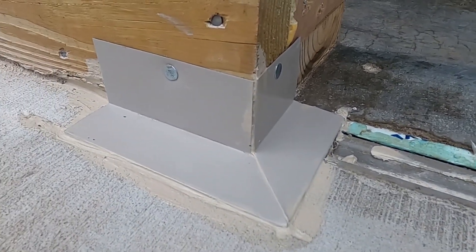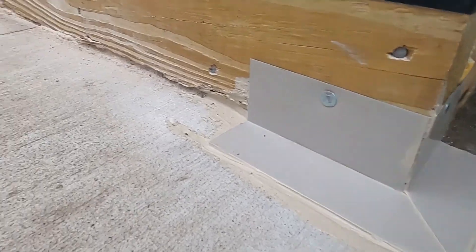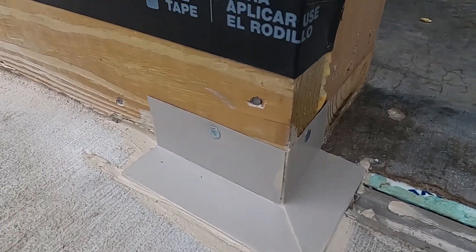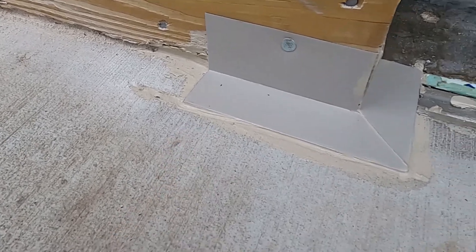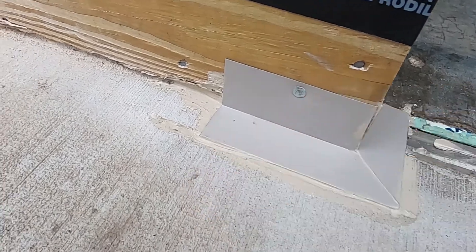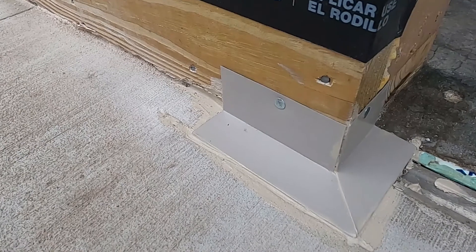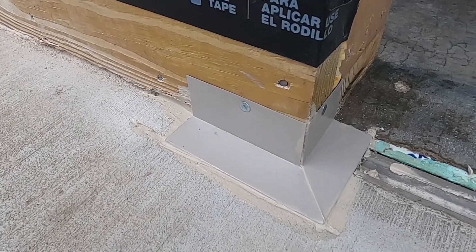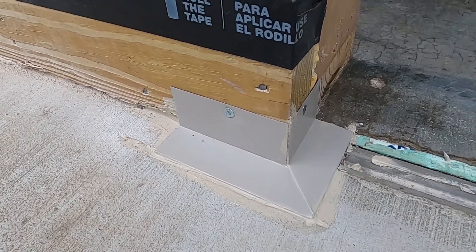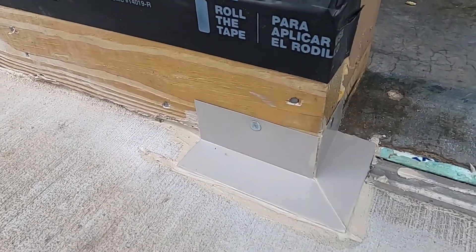It's not perfect, but it definitely adds some rigidity to this transition from the grade board to the concrete. I wish we could have done the whole thing, but we'll get to it later. For now this corner looks really good. The kerf cut was filled back in with polyurethane and the whole thing is stuck together. We put a couple of roofing nails into it to hold it in place — it's kind of jacked up against the kerf cut. We'll be flashing over the top in the corners, so there will be a good connection between the zip tape up here and the metal flashing down there.